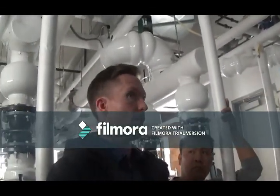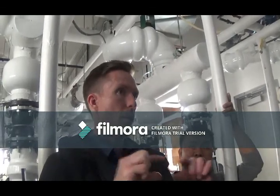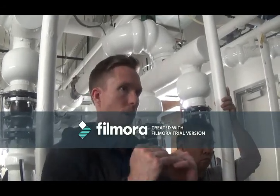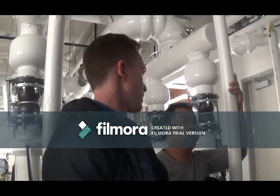If the boiler's not firing, that was the third final setup. It's a lockout, it's a red bar. That's a lockout, so it's your standard setup on any kind of gas fired appliance. When something goes wrong, it goes red, it won't fire until you actually manually reset it. Usually what the super would do, yeah, a hard reset, just power on and off. Okay. Is that fine? Is that okay? That's okay, but I wouldn't recommend doing it before you make a phone call.